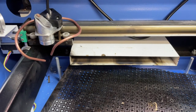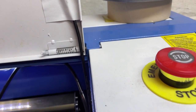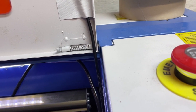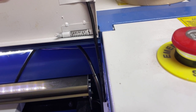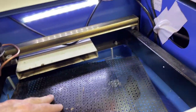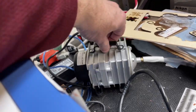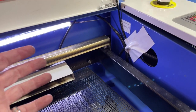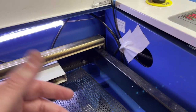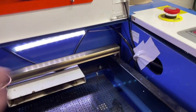That motor really puts out the air and I've already tested it — I don't get very many flare-ups at all. The only problem, and there's nothing you can do about it unless you build a box for it, is the noise. So if you're used to your laser and how quiet it is, now you've added this motor and it's kind of noisy. I saw one guy asking about a box — even if you lift it up, it doesn't matter if it's on the table or not, it still makes the same noise. One problem with putting it in a box to quiet it is I don't know if it needs airflow to keep it cool. If it does, you're going to have to have a fan built in to blow air on it. Not really sure about that — I just did get it. That's the only thing: you just have to put up with the sound.